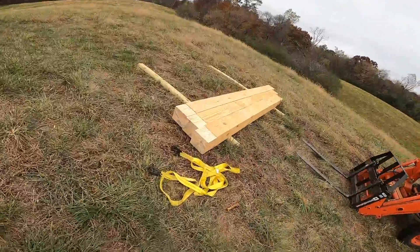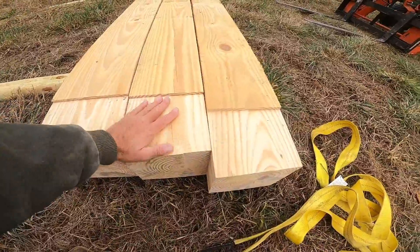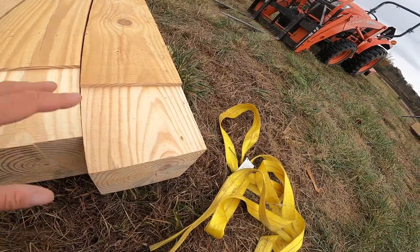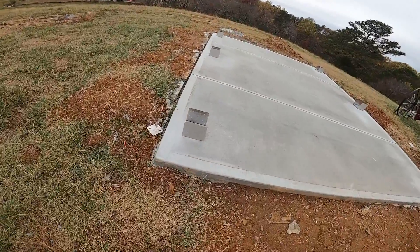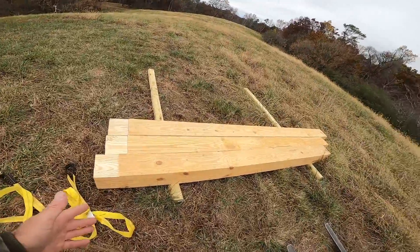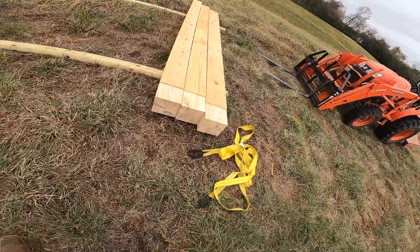I've got my first three of the six posts up here; the other ones are on the barn. It's been a little rainy so I don't want to drag them all out. My brackets are stainless steel, supposed to be eight by eight — and that's what my posts are milled to — but the actual inside width when they came in is seven and a quarter inside to inside. Because of that I had to come in at the bottom of the posts, cut them square with my chainsaw attachment on my circular saw, then put them on the sawmill and mill off just a little bit at each end so they'll fit in the bracket.